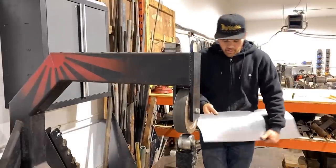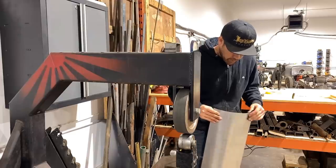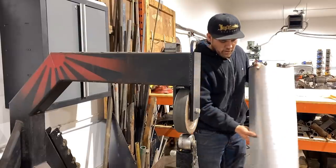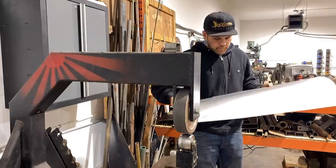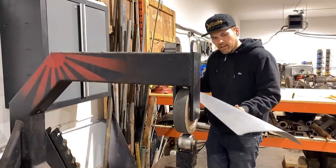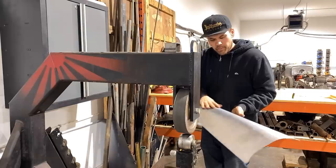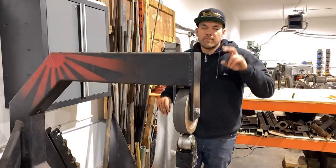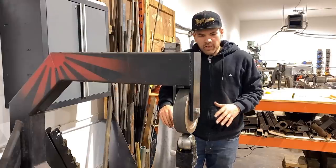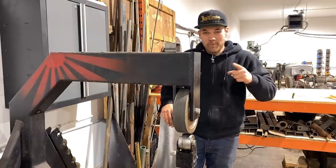We just checked it on the car and it's fitting pretty good in the lower area. I've got a little bit too much curve here — I need to flatten that out a little bit. With this six-inch radius lower anvil run across this area, it does need to tighten up a little at the front. We're basically just trying to rough it in right now. I want to get as close to the shape as I can relatively quickly, and then we'll tune it up. This is a learning experience for me too, so we're going to get through this together.